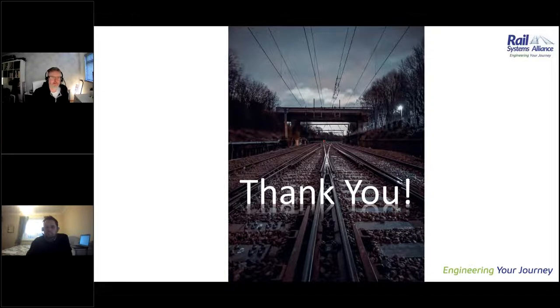Question from Shweeb here. He's asking, were there any adjustments to the existing catch pits? Did you have to replace them in a different location? We had to replace some of the catch pits with an S&C area with rodding eyes where they were too tight. And in the plain line sections, we also had a couple of instances where instead of having a G44 sleeper, we had a short-ended sleeper to increase the clearance between the edge of the catch pit and the edge of the sleeper.